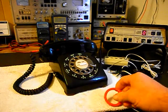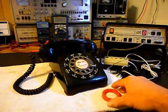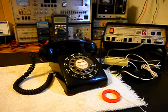Now we also want to mention our amplified pickup. We use this in troubleshooting, repairing, and on our final checkouts. It's amplified so that you can hear the audio from a receiver, and I have an amplifier backed by the video. It has a button on it — when I press the button I can give dial tone or take it away at any time. And since it's an open amplifier, it is prone to any static interference or noise in the atmosphere. So if you hear any noise during the final checkout, it will be coming from the amplifier and not the telephone.